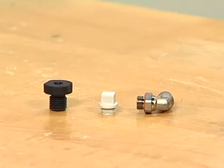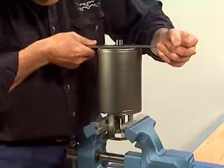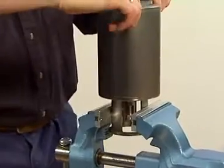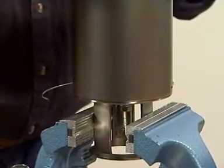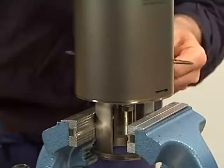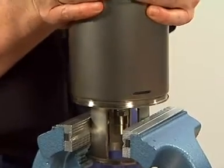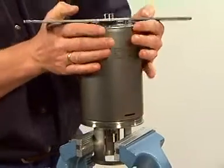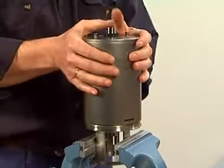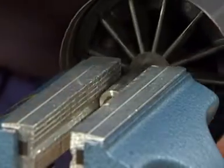Firmly place the cylinder unit and take care not to over-tighten it. Rotate the cylinder using the turning tool and remove the lock wire. Pull the cylinder away. Remove the piston and spring assembly from the actuator cylinder.